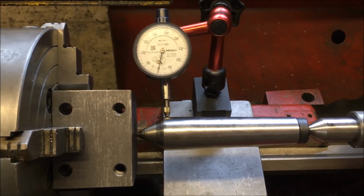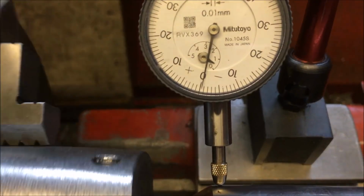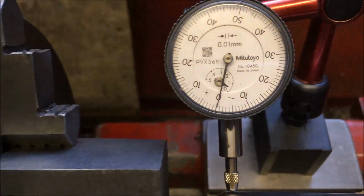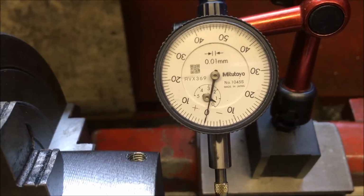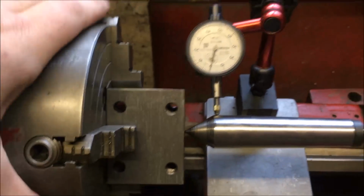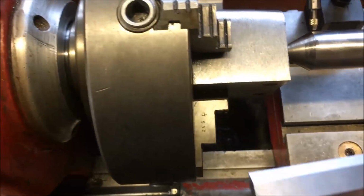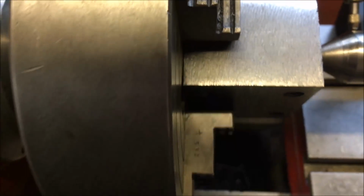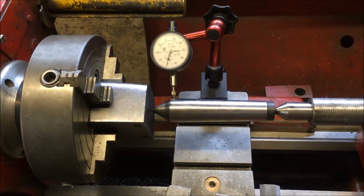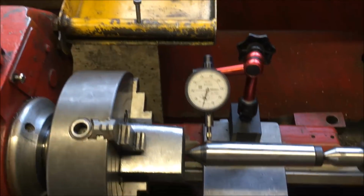Well, that was surprising. It only took a couple of minutes. So one division is half a thou, near as damn it, and that's moving a quarter of a division. Oh, thoroughly impressed with myself. Just got to check that that's still 90 degrees. To get some light behind it, but certainly looks all right. So I'll give them all a nip up, just to repeat it, and then start drilling it out, and then bore it out to, I think it's 32 mil we're going to go to.